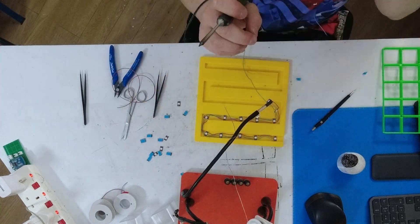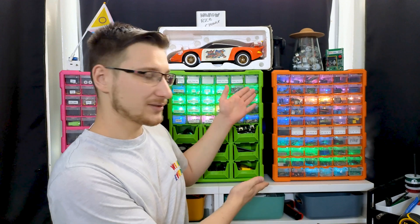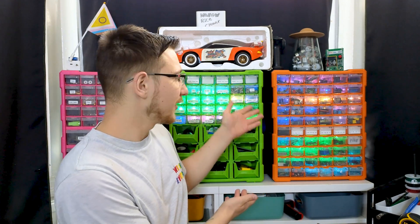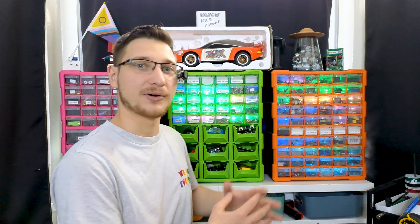Each individual square gets its own addressable LED, which I get on a spool of a hundred, cut down to individual LEDs, so I can put one directly under each box, and then manually solder on the three connections between every LED. Now I know what you're thinking — why not just lay down a strip of LEDs per row of bins and tell it to light up the ones per bin? Well, it's definitely not because Mimosa doesn't support addressing multiple LEDs per one item. We are working on it — very slowly. It's just never been a problem. These have a single LED behind each drawer, and honestly it looks really good, so we never bothered adding more than one per item.